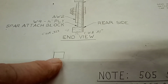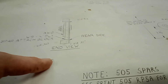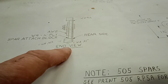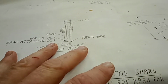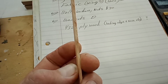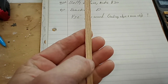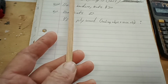And for instance, with geodetic, you don't want to take away from the 1/8 inch dimension. So since you're going to take it down in just one dimension, it's going to be 70%, and it's a 1/2 inch, so that'd be 350 thousandths. So the geodetic will only be 350 thousandths wide, but it'll be the full 1/8 inch. If you go much thinner than an 1/8 inch, then it becomes too flexible. But you can reduce it on its 1/2 inch width. That's 350 thousandths wide, and that gives you plenty of strength because it's commercial white ash, and that's the only reason we're reducing it anyway.